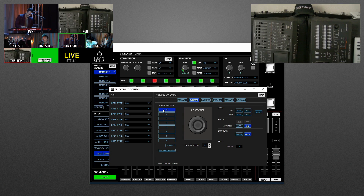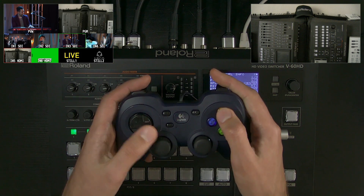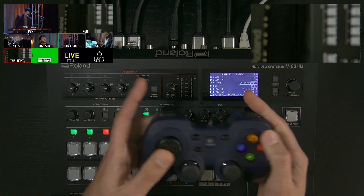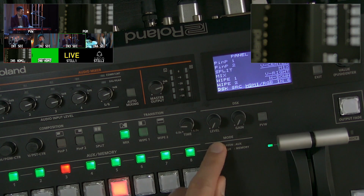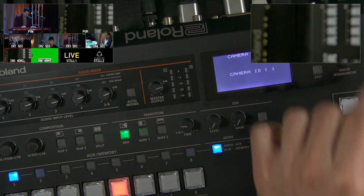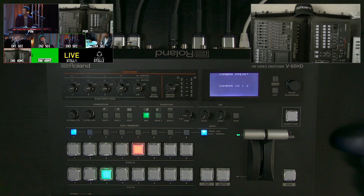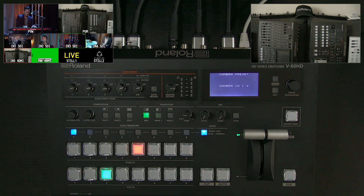Here's a USB gamepad — it has X input and is plugged into the same RCS computer. Using the joystick, I can control cameras; I click to change over to camera one and adjust that as well. To reset cameras, I can recall presets in RCS or via the hidden mode on the panel: press and hold the mode button until it's light blue, and for the six cameras I can recall up to eight presets each. This demonstrates a single-operator workflow — gamepad control, software, and the panel for preset recalls — offering a lot of flexibility. You can control up to six cameras, and if the camera supports tally, you can map the tally light to a crosspoint.